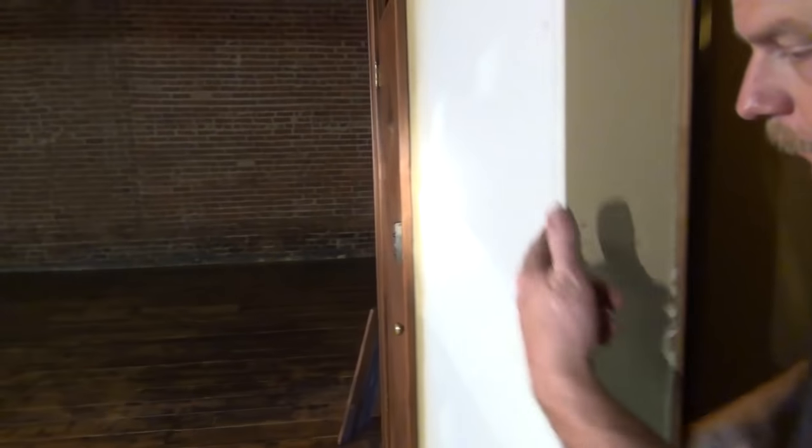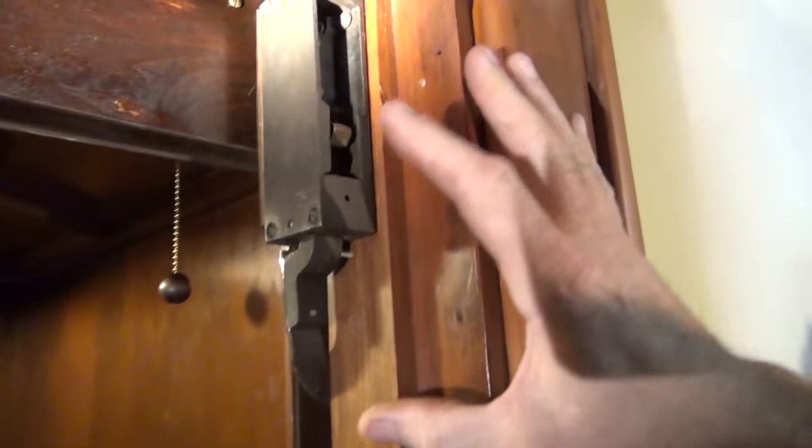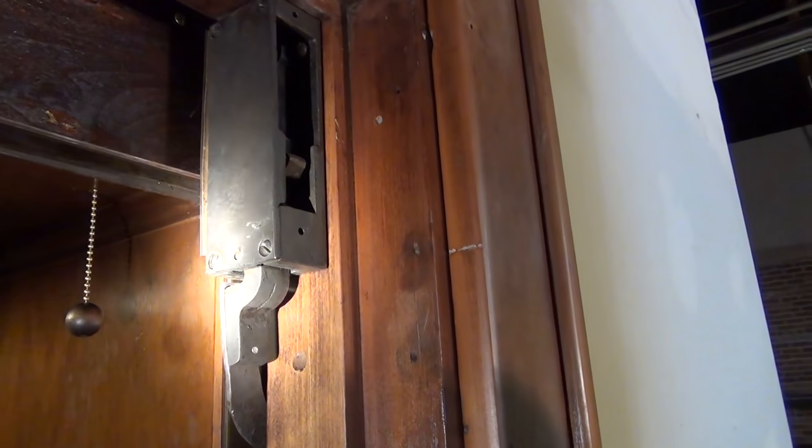Yeah, so really, most of the safety on this elevator is actually integral to the original design. We can look in the front here and talk a little bit about safety. We've got a door interface lockout. This keeps power from going to the elevator when the door's open. The elevator's disabled. This will prevent somebody from running the elevator down and leaving the door open, so that somebody can't walk into the shaft. This is the original running cam right here too.